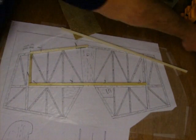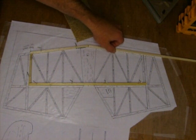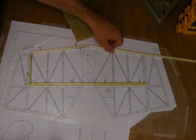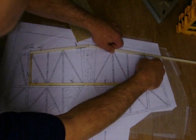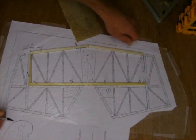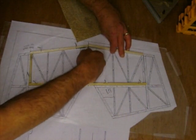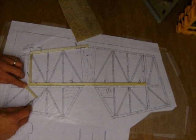And if you're like me, you have workspace issues with your lumber, no problem. So on this one, you can see you can overlap it and make your mark, or just make the piece smaller first. So we'll just start with an edge, which is going to be approximately there, and just pick up the angle that you need. Slice it down. Like I said, if you go a little bit over, no big deal. And then I'll line that edge up right so. Make a mark right there.